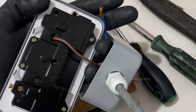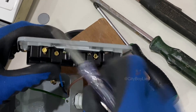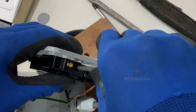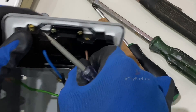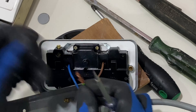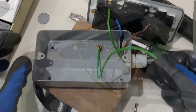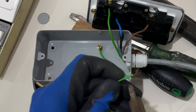For wiring, remove the insulation roughly 2 cm and fold into half, then insert into the respective terminal. It's color coded again: L is for brown, N is for neutral which is blue, and earth is green. You need an additional wire to ground the metal casing — it has a terminal for the metal casing for safety purposes.